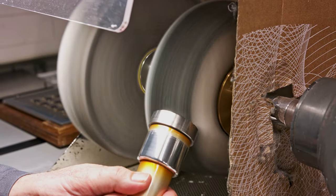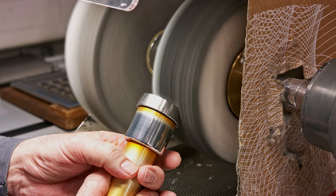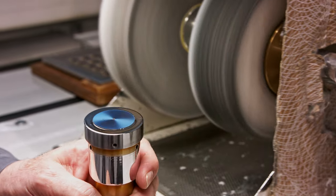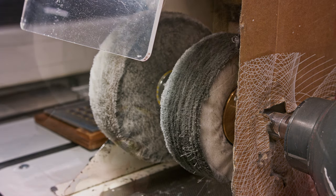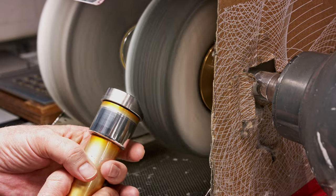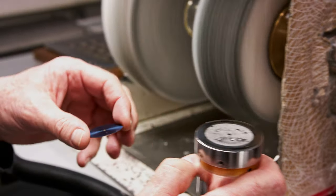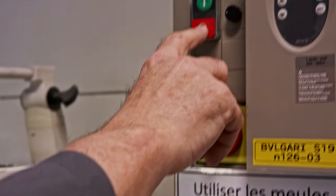What we saw first was just an initial step to achieve the right thickness and get a super flat surface. Now you want a beautiful dial that looks gorgeous. The operation done here uses cotton turning at about 780 turns per minute — different strengths of cotton, one more aggressive, the other less. It is the operator alone who knows how much pressure to apply, at what angle to bring the piece onto the cotton, and for how long. Only his eyes and his experience tell him if the result is right, and the dial is now ready to go to the next workshop for index assembly.